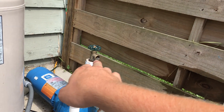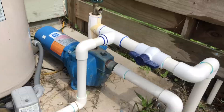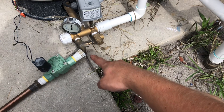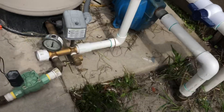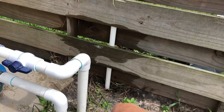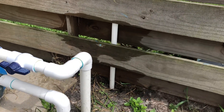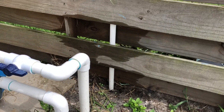I have a little boiler drain up there to prime the pump — I hardly ever use that one up there. I normally use this tap coming out of the pressure tank. And I have another tap on that side of the fence. That's where the main line drops down, inch and a quarter, going out to there — I have it capped off about two feet into the yard. So when I'm ready to put the sprinklers in, I can just uncap that main line and trench from there, running the main line around the house.